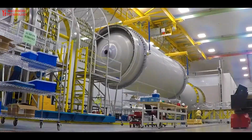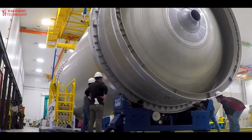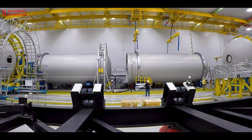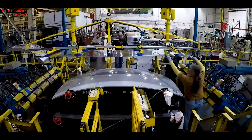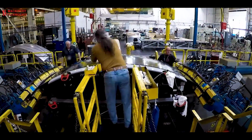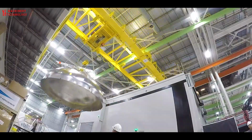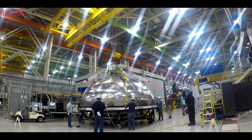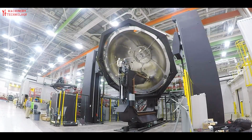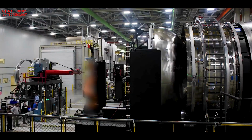in the booster stage, stretch forming gore panels for the Centaur second stage propellant tanks is underway, using stainless steel. Gore panels are welded together to create a propellant tank's dome. The gore welder is one of several highly specialized welding stations in the Centaur production process. Just down the aisle, Centaur V's massive intermediate bulkhead is mated to the ultra-thin tank. Once both propellant tanks are welded, they are mated together to create a Centaur V second stage.